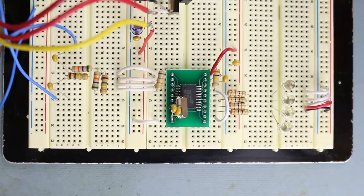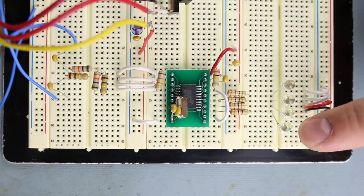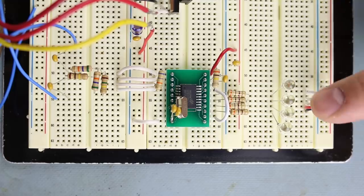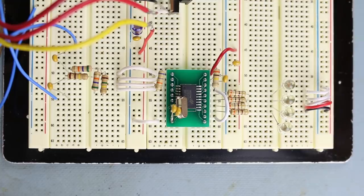Now, I can ring multiple phones at the same time also. So if I want to light up these two phones, I would add these two together, 1 and 2. That would be 3. If I wanted to light up these three, it would be the equivalent of 7, so 4 plus 2 plus 1. If I press 7, there we go.